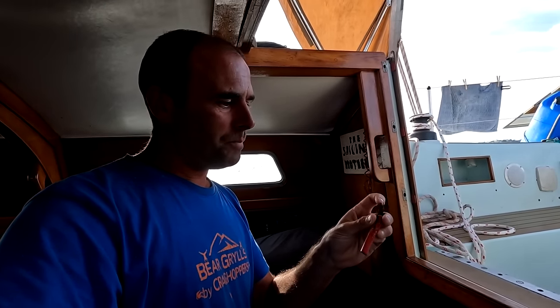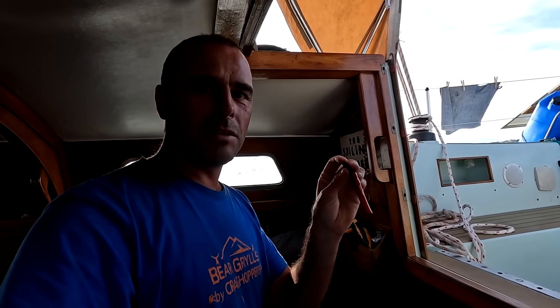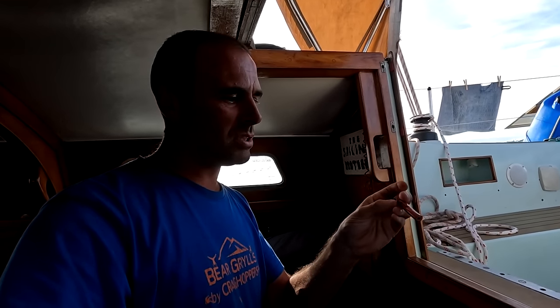When a wire is not crimped properly, you get a lot of amps going through a little tiny bit of the wire, which causes it to heat up and burn. Luckily, this didn't catch fire. So this is a great lesson. So we've moved from the island over to outside the river mouth where we were before, and tomorrow morning we're going to get a new wire and we're going to crimp it and put it on the alternator, and hopefully, fingers crossed, there are no more problems, because we are dying to get this circumnavigation of New Zealand underway.